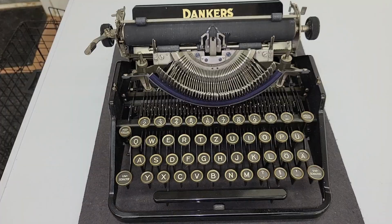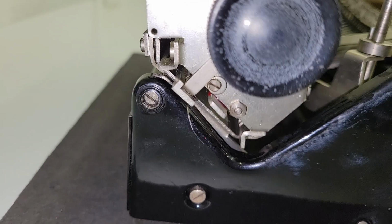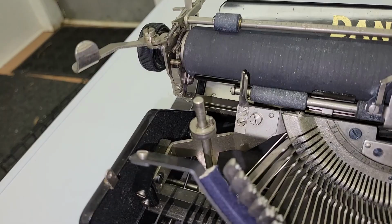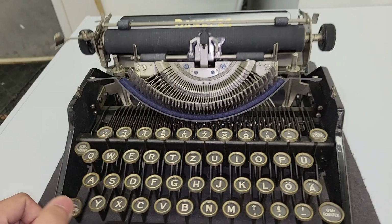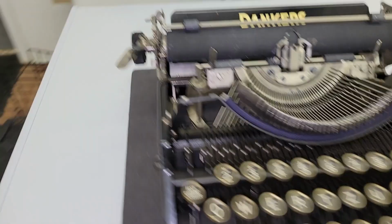So instead of that, we have the carriage here moving about a single pivot. So basically that's one other way to do things. I'd say it typically gives a lighter carriage shift operation, or just a different style or feel. Potentially could save some parts, but anyways. In terms of the Antares and Silver Seiko, those two machines have different ways of conveying motion to their single-pivoted carriage shift.